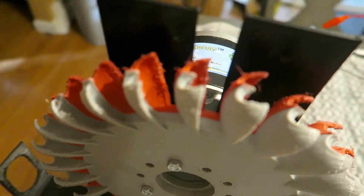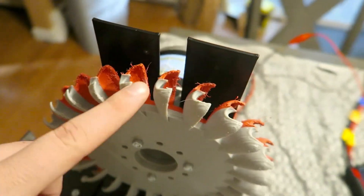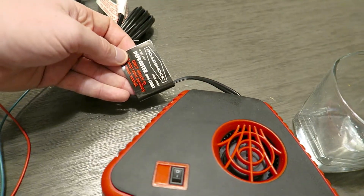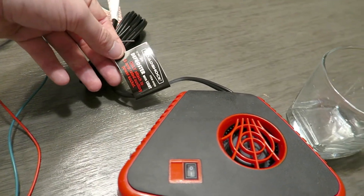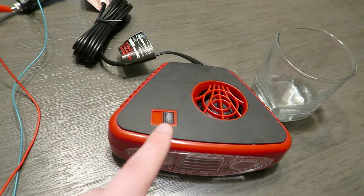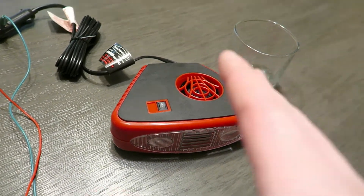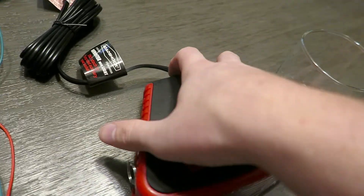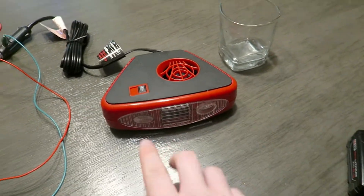With that design, this one might be hard to tell the depth on video, but it's not a very sharp transition, so I want to work on that. For the power test right here, I got one of these little Roadshock defrosters from Harbor Freight — it was like $10, cheapest thing I could think of — attached to a 15-amp rated auxiliary power socket. It's 12 volts and the rating is about 13 amps, so if my quick math is right, that's about 156 watts. It has a little light on the front, and then a fan and heat mode.